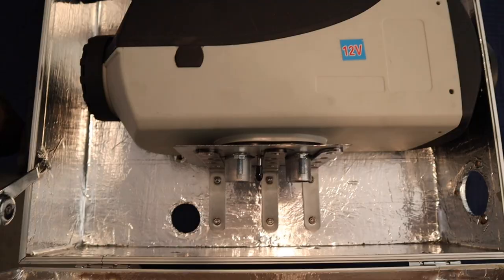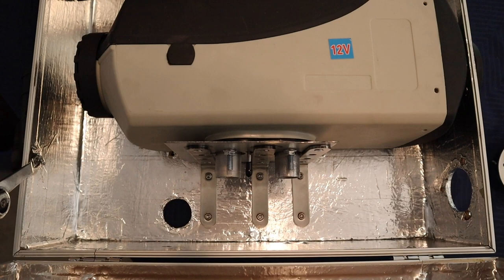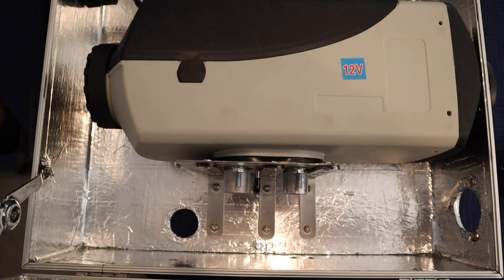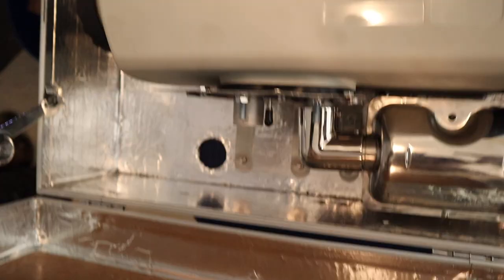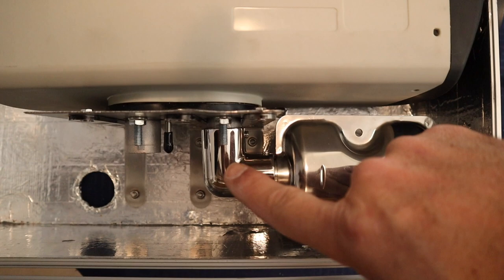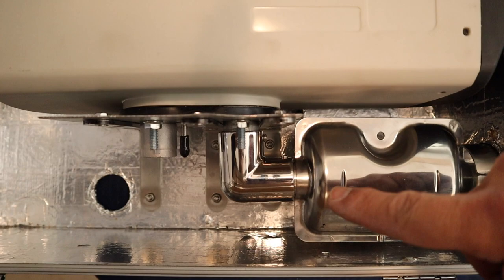Some people have tried copper fittings, and there's even heater specific 90 degree angles that you could purchase online, but I found this stainless steel option very inexpensively on Amazon, and I'll include the link in the description section. With this inexpensive fitting, you could connect a 90 degree angle to the exhaust port of the heater, and then at any joints, use high temperature silicone to prevent any exhaust leaks. However, there is one problem with this plan.